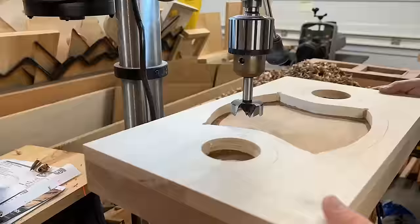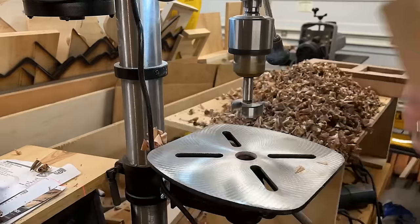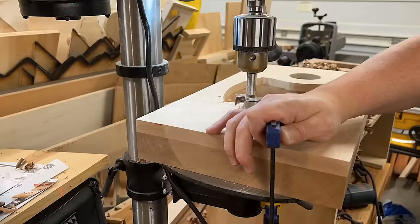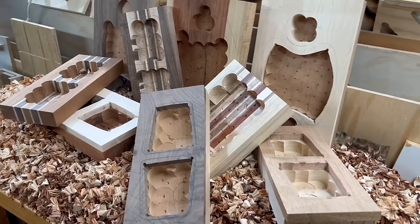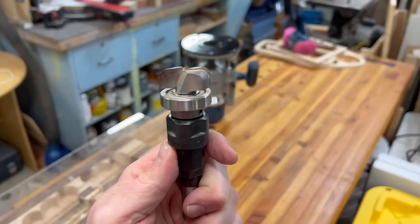If you don't have a powerful drill press, there are other options — like using a straight bit or a spiral upcut bit, similar to what I did in my router bowl video. Here's the same process for the one where I already removed some material — I still want to remove most of it at the drill press so it's not all on that router bowl bit. You can see it's still messy, but I removed a lot. This makes a lot of wood chips, and I get that — but this is the same process as bowl turning. It's going to happen.